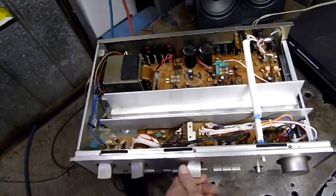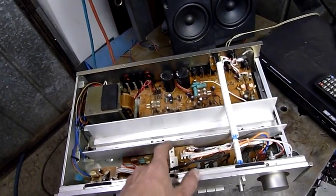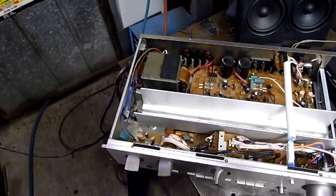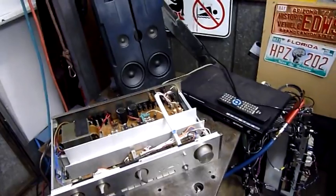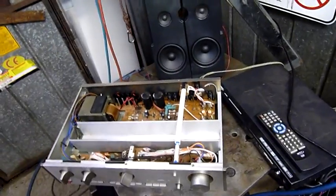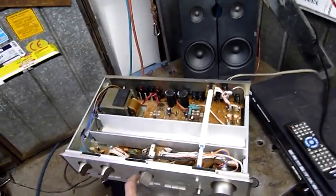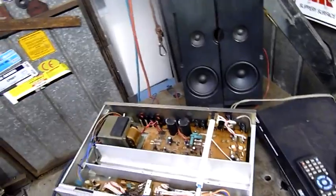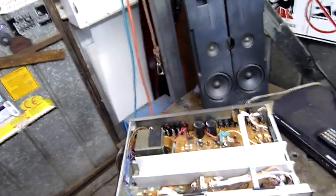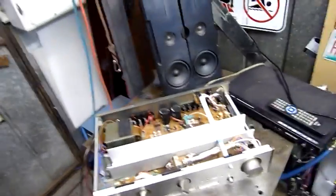It's basically all I did, is just cycling through it, and some of the channel noise went, so that's my candidate for repair. Everything else works fine. Yeah, had it cranked up fairly well before and not a problem. So it should be a good runner if that's the only issue. I'm curious about those Zener diodes, but again, they probably just got a bit hot during a party one night, and that was about it. Like someone had it pegged, and yeah, she got a bit warm.